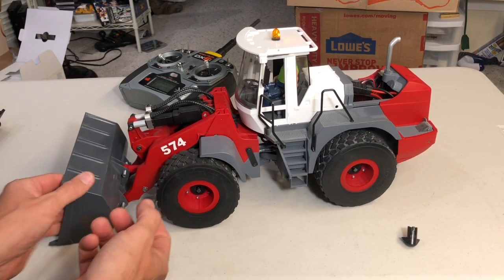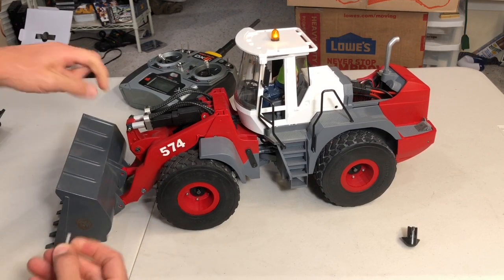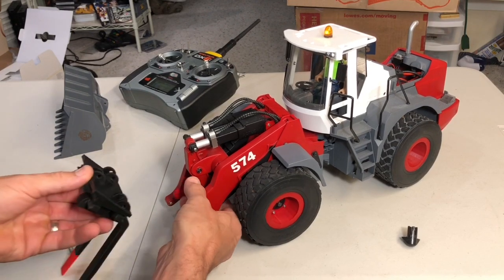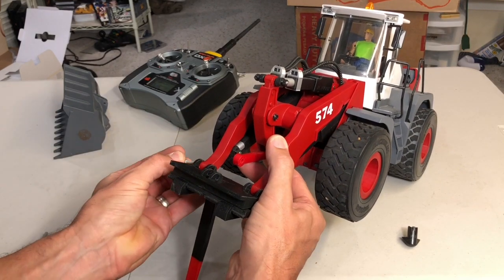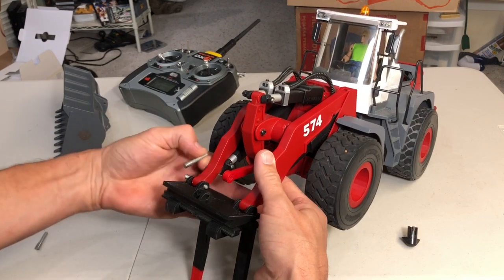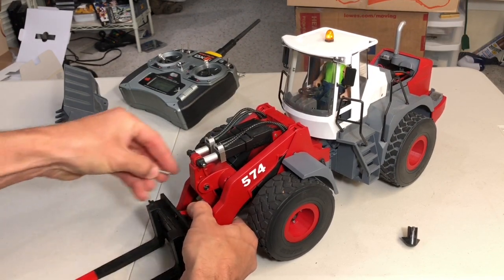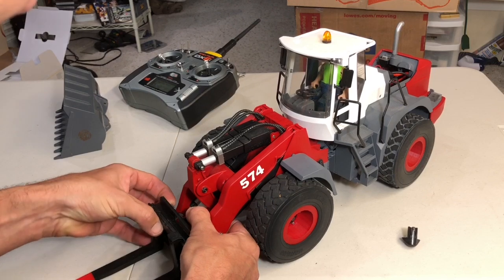As far as your fork design — I'll make some extra rods. There are three pins here that pull out — one, two, and then this one over here — and your bucket comes off. I'm actually pretty impressed with this one because I redesigned it just for you guys. What I like to do is flip this up and set it on the edge of a table so you can put the fork system in. The pin goes right back in there — these are 3D printed 100% infill pins. Put your two bottom pins on and bring it down, then put your third pin in.